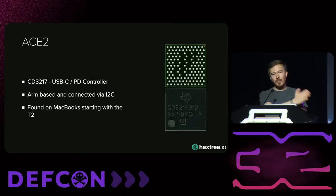Basically, our user space application talks to the IO kernel read-write module loaded into the macOS kernel, which talks to the memory-mapped IO peripherals, which toggles the physical pins, which then talk to the ACE2. I implemented a debug probe over this that lets us dump and modify the ACE2 from user space. You can just call ./ace2dump and, assuming you have this kernel module loaded, it will dump the firmware of the ACE2. I wanted to build some payloads and debug them, so I ported this entire thing into OpenOCD — introducing Tamarin kernel, essentially an OpenOCD driver that bit-bangs SWD on Apple SOCs through the IO kernel read-write module.